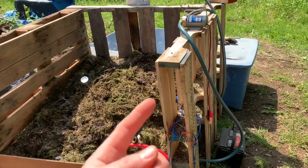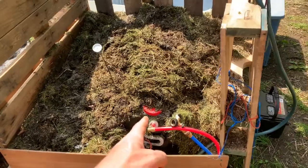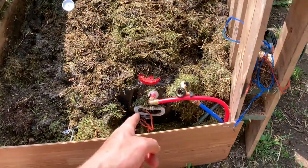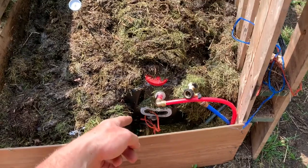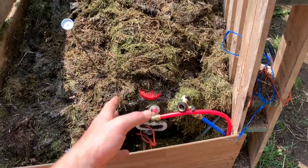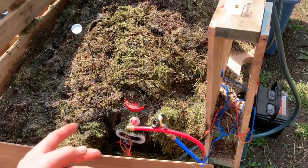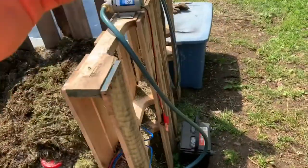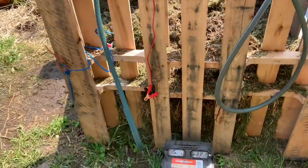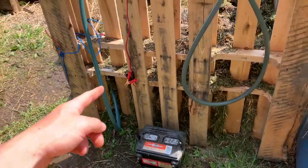Most of the time you draw from the top of your tank because that's where the hot water rises, but in this situation I want as much water as I can get, so I have it drawing from the bottom. The tank is encircled with heat so I don't have to worry too much about that. If I had coils I would take it from the top and run it up, but doing it differently this way and it works, so I have the water coming out to the pump.